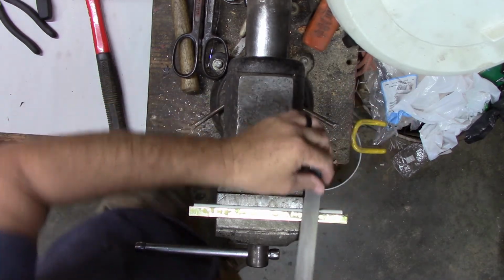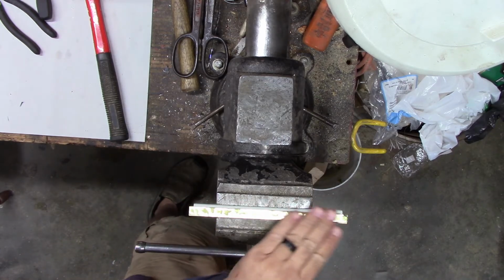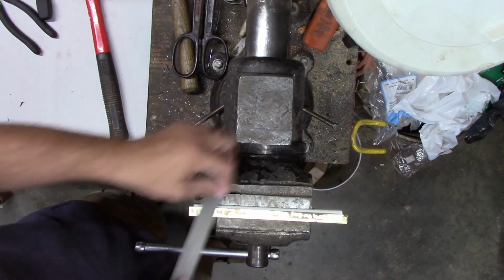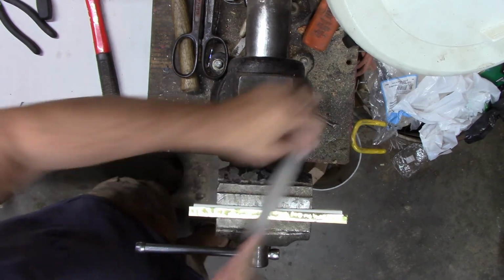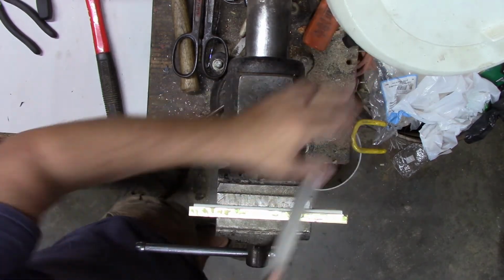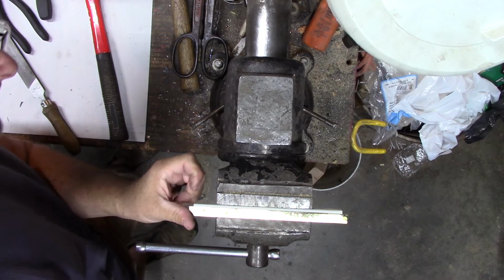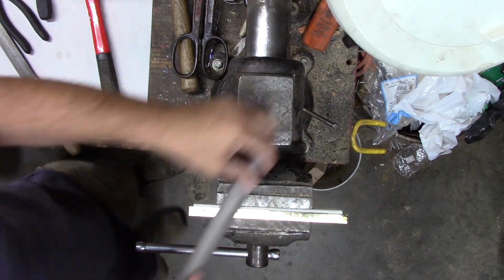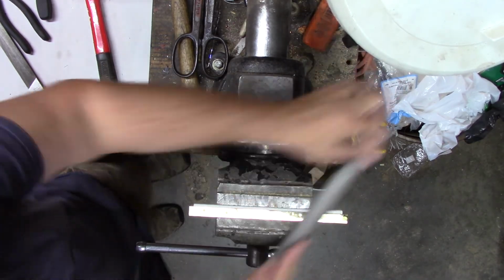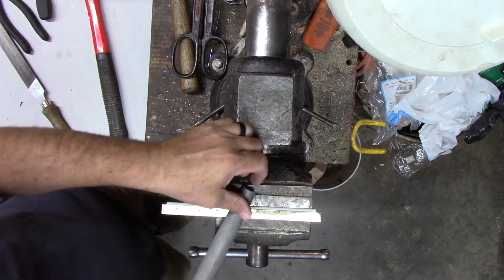You know, those dents showing up, probably see that. I don't know, might be too much glare. But the idea is all those dents, low spots and high spots, see if we can knock them down a little bit so we can level them off, and the whole thing looks a little straighter. Pretty big scratches right there. Getting there. I'm going to get it too thin. Keep an eye on it. If we have to, we can get under there and pry those low spots back up. Make sure we don't get it too thin.